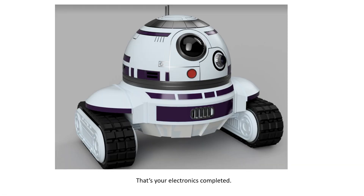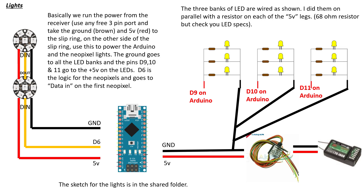For fault-finding: if you can't get things working, check all your connectors. If you can't get the LEDs flashing, make sure you've got the orientation right — LEDs only go one way, one leg positive and one leg negative, you can't swap them around; it's not like a bulb. Do a little research and reading up on LEDs and how to connect the resistors.